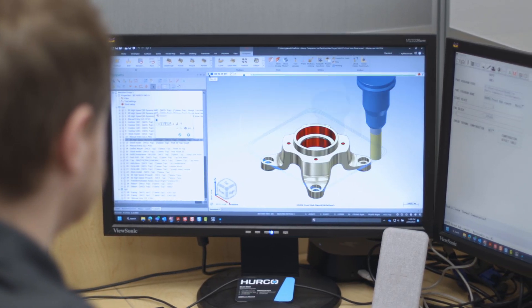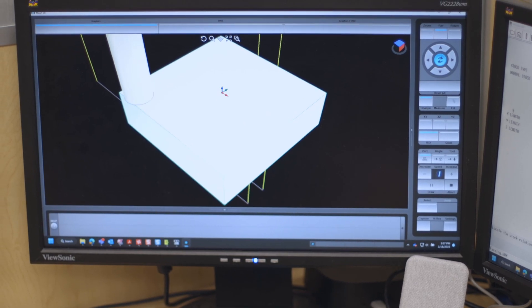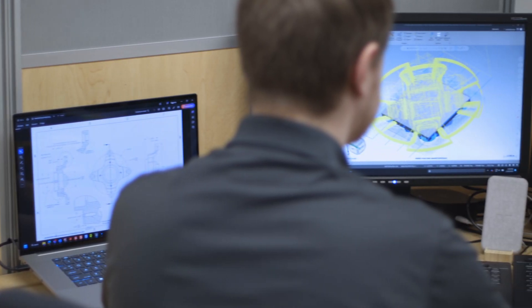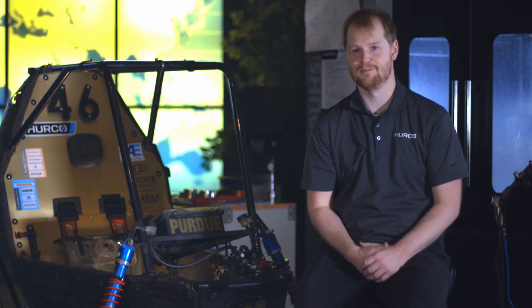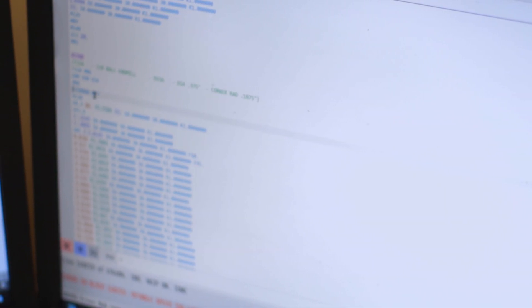With my background in Mastercam, I went to Mastercam to program this from start to finish. It was programmed using both OP1 and OP2 with a little bit of conversational code for the mid-ops when we're touching off the part. The NC code for each op is about 500,000 plus lines of code, and this machine chews it up like cereal. The main challenge was making sure we didn't have any collisions, but once we could see them in simulation, we tracked down exactly what line number the problem happened on and corrected for that issue.